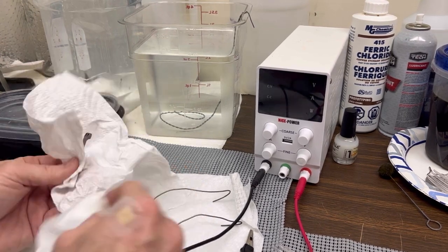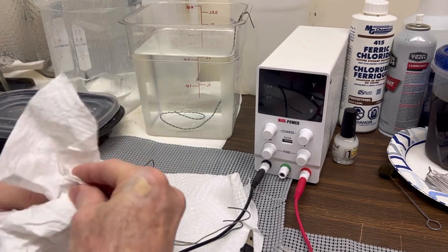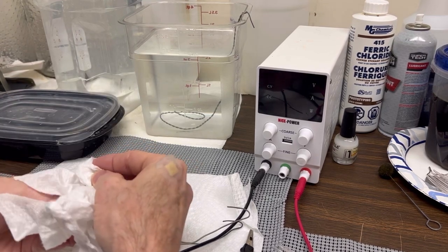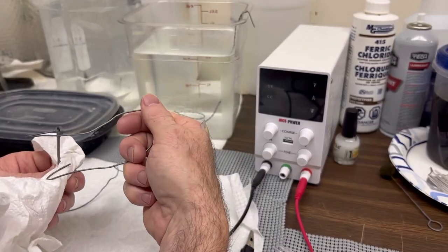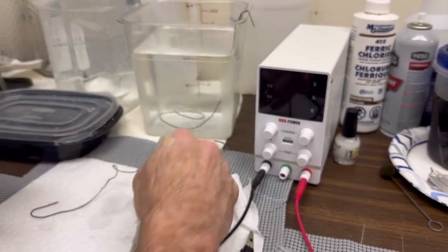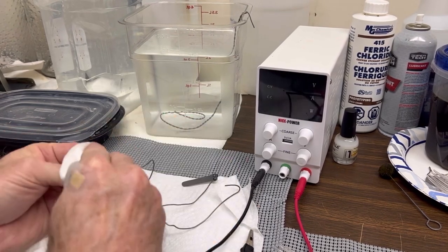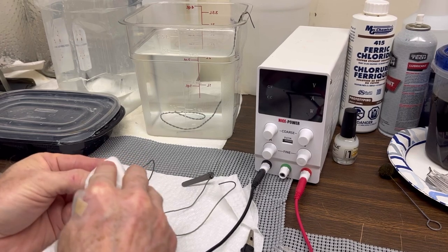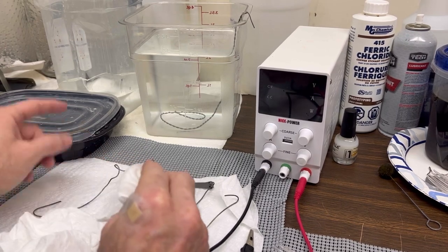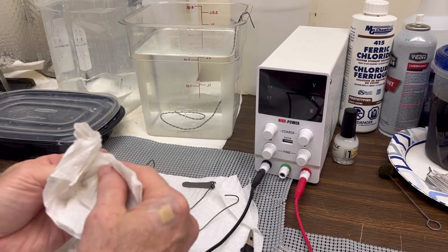Because when I first started doing this, there were times where I didn't clean the oils right, and I'd anodize, and I'd have a spot that was a different color than the rest of the titanium. And what that was, it still had the oils from my skin on it, or oils from somewhere on it, and it just didn't take the color right. But when that happens, all you got to do is repeat the process, clean it, etch it in the acid solution again, and anodize it again, so...